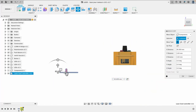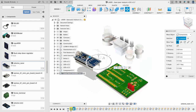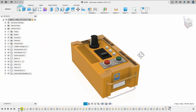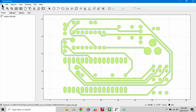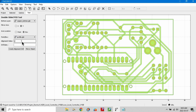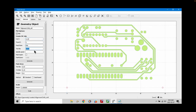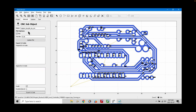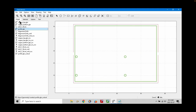After stabilizing the electronic circuit, I uploaded it into Fusion to verify it fits inside the enclosure I previously designed. The next step was loading all the files into FlatCAM. For each file I generate a geometry file, then from the geometry I generate a toolpath, and from that toolpath I generate an NC file to be read by my CNC — one layer for the top, one for the bottom, one for the holes and drills, one for the profile — and then I load bCNC.